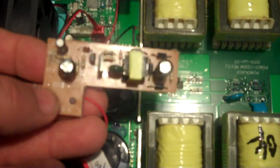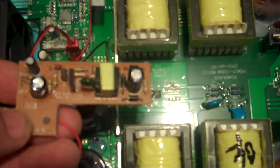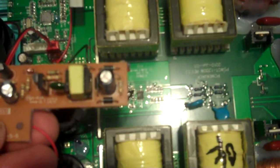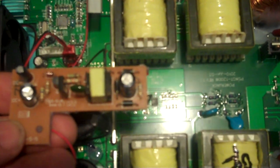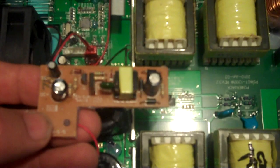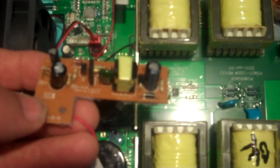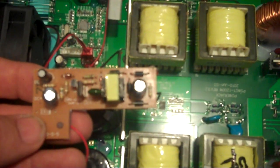I've looked at the numbers on it, searched all over the internet, can't seem to find any information. There's an S-01A number, and then inside a little circle the letters TA, which doesn't really mean anything. Then there's a 94V-0, and I found that is a designator for some level of fire resistance — it meets some kind of standard as far as fire tolerance. But it really is not an indicator of what the board does or who manufactured it.